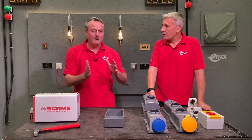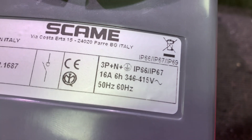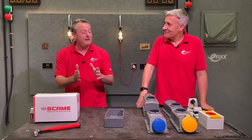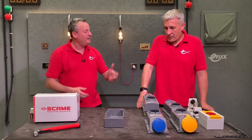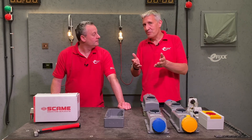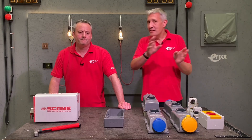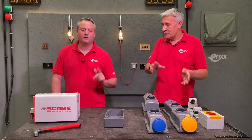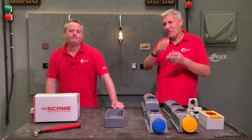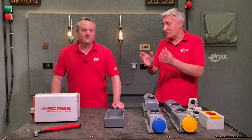We talked about those environments and that links into its IP rating. What's the IP rating of the enclosure? This comes with IP66, 67, and 69 ratings. In previous videos I've learned that doesn't mean because you get 69 you're given the other ones as a freebie — no, they're all separate in their own right. IP69 is hot jets of water. A little bit of confusion comes in with 67 and 66 because 67 is temporary immersion in water, while 66 is high pressure jets of water. Some products may pass a 67 test but not a 66, so always look for all of those ratings together on the manufacturer's product, which means they've done all of the tests for those different scenarios.